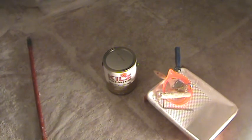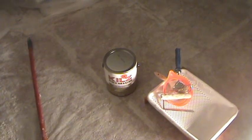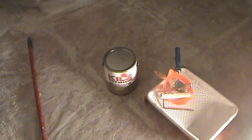You know, if you've got a question whether or not your sealer is going to work for your project or not, get a stain blocker. This also blocks water stains. There was no water stains up there or anything, by the way, but you saw the sheetrock, it was all discolored. I never would have thought the sheetrock would have discolored being under a popcorn ceiling spray texture. You know what I mean? How could it yellow? I don't know.